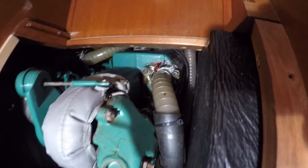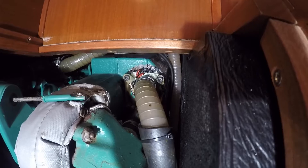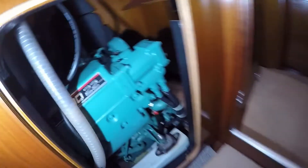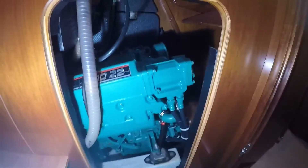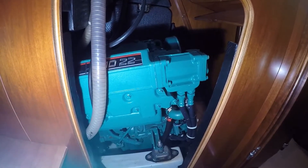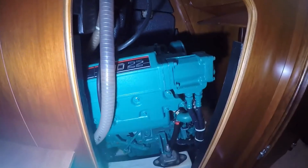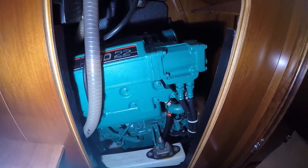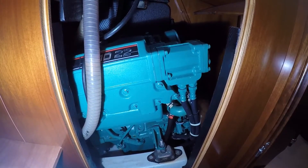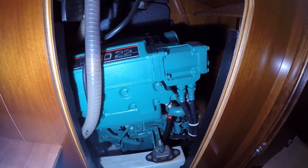The reason for this change, as you can see here, is the corrosion on this part of the exchanger. The aim is to try and do this with the engine in situ. Access is not too bad on the 473 as I can get towards the front, back and side. However, the only problem I foresee is removing the exchanger off the block, because there are two stud bolts which I'm going to have to try and reverse-undo — actually remove them as bolts rather than studs.